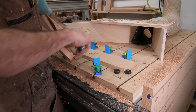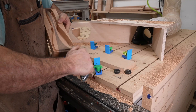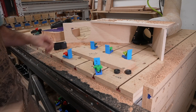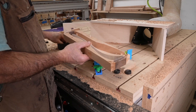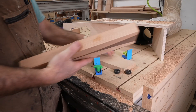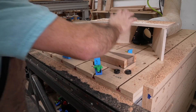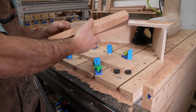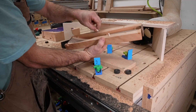That upcut bit will sometimes leave fuzzy parts on the top of the work piece, and you don't want these to stick up and affect the thickness when you do the bottom side, so I trim them off. I've also gone to using a quarter-inch downcut bit to do my roughing because my passes are so shallow, and that way I don't have to do that cleanup step. I put some quarter-inch wood dowels into the piece to locate the bottom, and I cut my alignment holes a little too shallow in the VCarve file — I've since made them deeper. If you don't get the dowels seated all the way, the workpiece will be rocky and not sitting flat, so make sure nothing is underneath making it stick up.